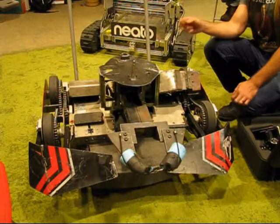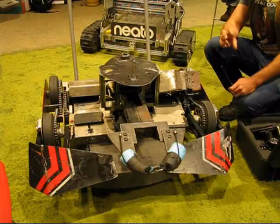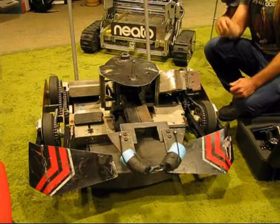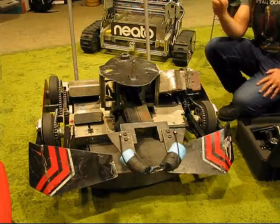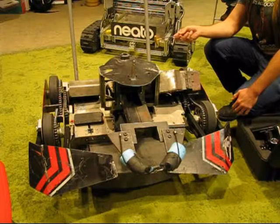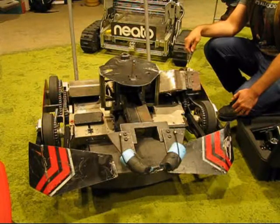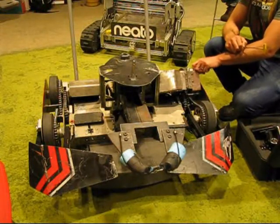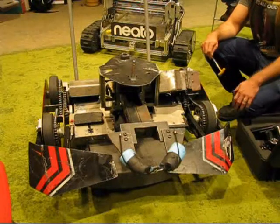The other configuration that I have is called Predaraptor, and it has the big claw jaws on top. It's a really effective robot. Because if you grab somebody, it's got that much power behind it, you can pick them straight up and put them over your head. The last match I had in that configuration was against Sewer Snake, which was Stinger from the BattleBots show. Anyways, I'm running just Robotech speed controllers. I've got a Robotech on this head. I can drop 300 amps into this one right here. It stalls maybe a little bit more than that, but whatever the case, that gives me all the power I could ever use, just that 1 second pop that I really need.